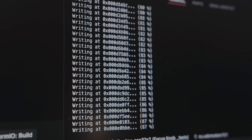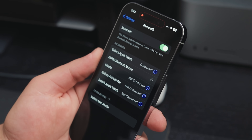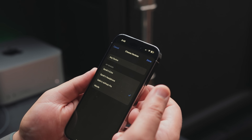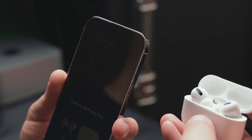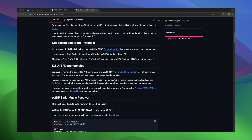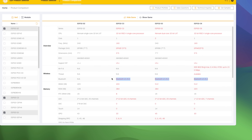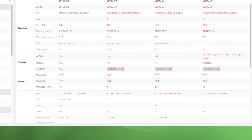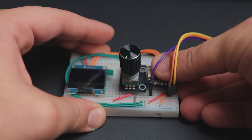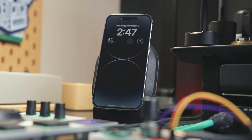Now I just needed to replicate this with the ESP — except it did not work at all. I tried emulating various devices like keyboard, mice, and media controllers, but none of them appeared in that list even though they showed up and were recognized in the Bluetooth pairing. I almost abandoned this idea. Then I realized all the devices in the list are audio sinks like speakers and headphones — that's why it worked with my AirPods but not with the ESP. So to fake an audio sink, I used a library that makes it super easy to set up Bluetooth audio. But I had a different problem: I started this prototype using the S3 or C3, which like most of the ESP lineup supports only the modern BLE standard, not Bluetooth classic needed for audio streaming. Luckily, Adafruit also makes the ESP32 Pico that supports Bluetooth classic in the same form factor. I swapped them out, and now we have a fake audio sink that spins the entire Bluetooth stack to only connect and disconnect from the phone. This triggers the personal automation without any extra intervention — and that's what I mean by the jank. But hey, it works.